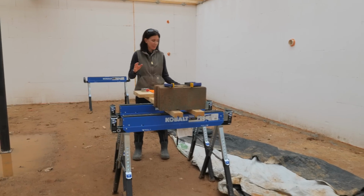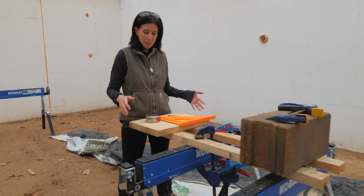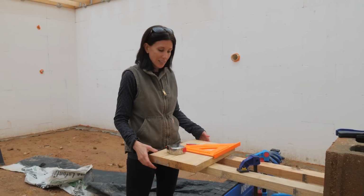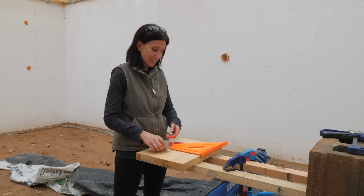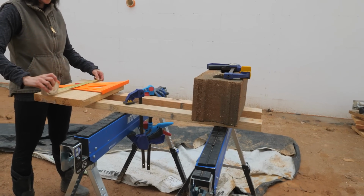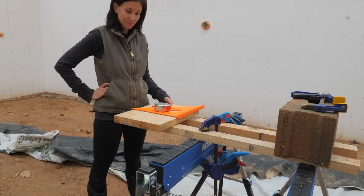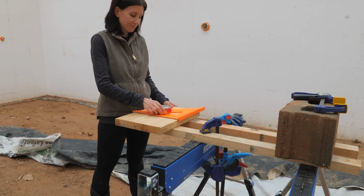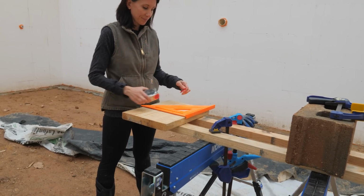All right, so come here. I want to show you my little table set up here. So I'm going to be the one sawing the bracing in between the joists, and need to make these about 14.5 inches. So this is my little table rig for sawing. Well, the good thing is we don't have much waste at all, because we took 16 foot 2x12s, cut them down to 14.8, and that left us enough of all these little cutoffs, so we can just trim them, and we have mid-span blocking.